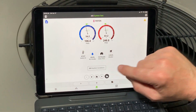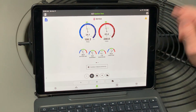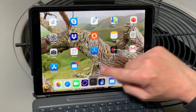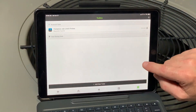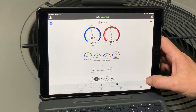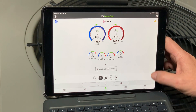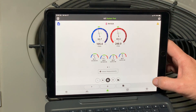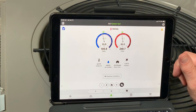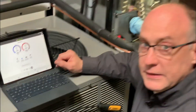That's pretty much it for FieldPiece. When you go through, it maps everything to the app, maps everything to the targets — very easy to use. And once you get this mapped in, you're good to go. If I power this off again, double-click it, swipe the app shut — as soon as I open it up, go into the toolbox, tap on FieldPiece, and by the time I go to the home screen, everything's reading again. It's that fast. The superheat will come in just behind it — there's my superheat, my subcooling as those probes connect in. Outdoor air, return air, wet bulbs and dry bulbs, and everything's ready to read. You can see how quick this is once you get the meters connected — it makes it really easy to manage the app. This is Jim Bergman with MeasureQuick. Thanks a lot for watching.